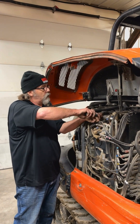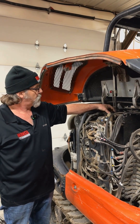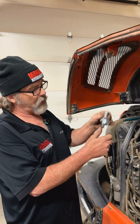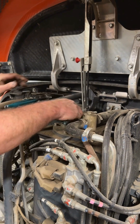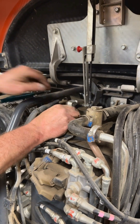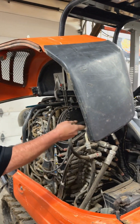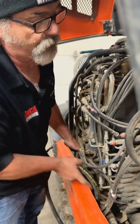The Kubotas use an oil plug that has standard British threads on it. So what we do is remove the fill cap — we send you with this adapter and this 90-degree piece. The oil cap is replaced with this plug; you screw that all the way in where it will seal like your cap did. Then this piece is able to be pivoted so that when we route our hose, I found it's easier to go down and under this latch so you can get a straight shot right back to the top.